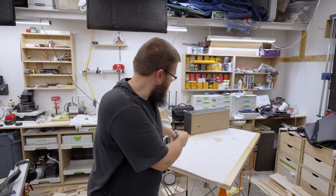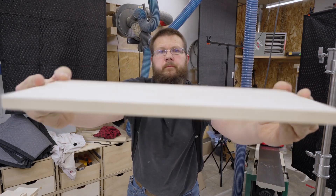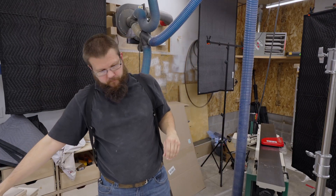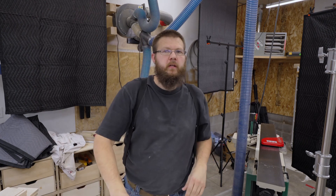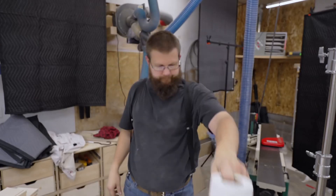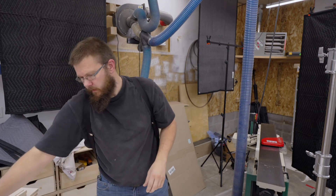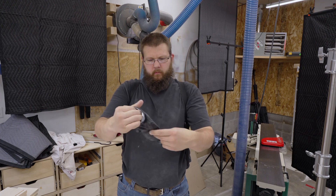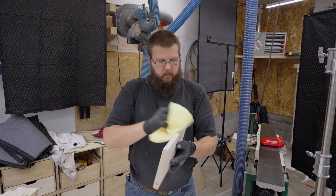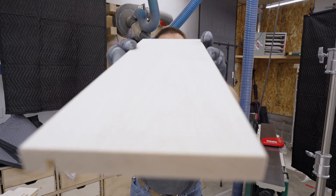We're going to do the work on this bench right here. My drawer parts are prepared — solid maple, sanded to 180 grit. I'm applying the finish with a two inch foam brush and wiping it off with a paper towel. This is oil-based so it can get a little stinky. I don't think I'll have too much trouble — I don't have a lot to do here. I do wear gloves though, just wiping it off with a microfiber rag.